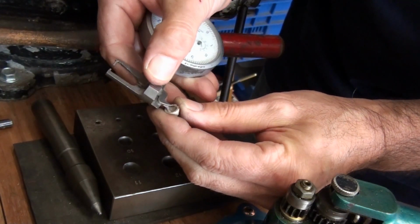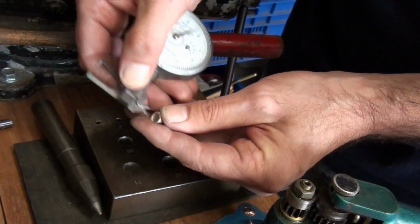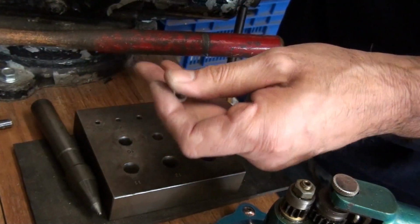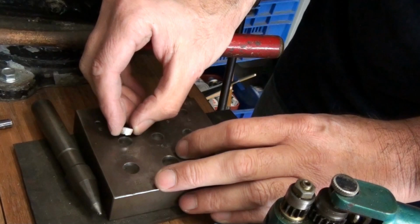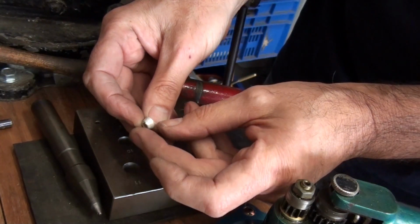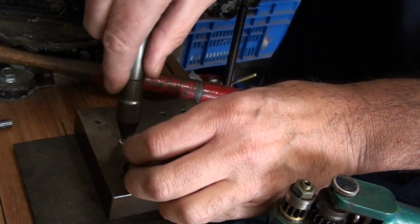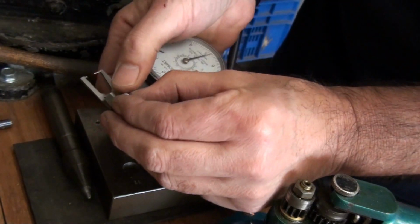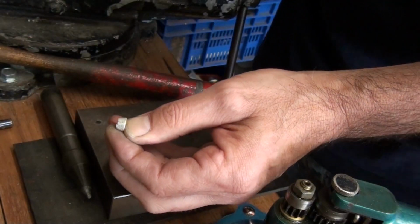I'll pickle that now. A little bit of a measurement check tells me now that I've got just about 6mm inside diameter, and outside diameter is over 9mm, so it's quite a large setting still, but the stone will sit on top and not inside. I'm going to now increase the height of the setting. I need a little bit higher, so around about a height of about 5mm, a comfortable 5mm though, so I've got pretty much 5mm there, so I'll take it to about 5.5 because I've got that little dip there that needs to be filed out.